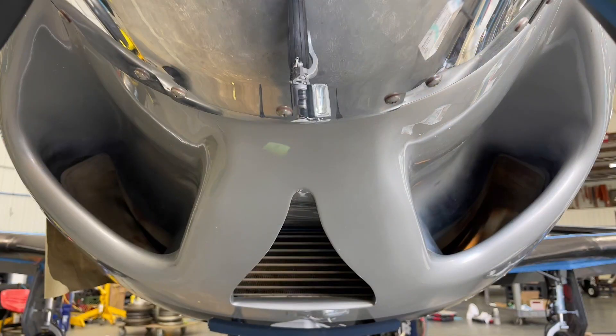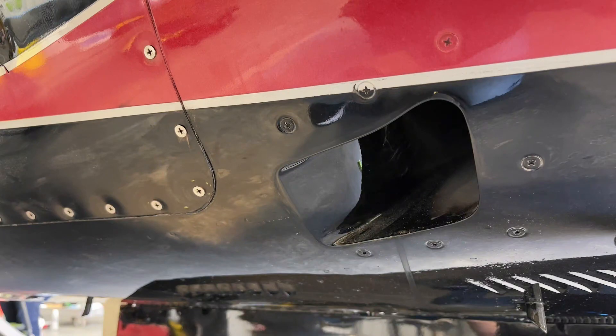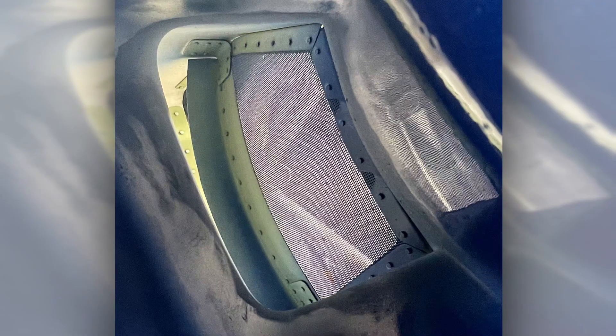Let's start with the Meridian. A Meridian has an intake and also a port in the back where the air comes in, gets thrown to the outside, and then goes out these little holes in the back. Those holes in the back can also be intakes under certain scenarios. A Meridian has a screen at the very back that stops FOD ingestion, but jet props don't have that screen. The Meridian has a more robust intake system for FOD protection because of that screen, but it's not adjustable whatsoever.